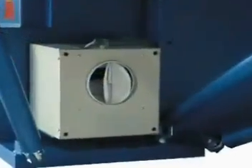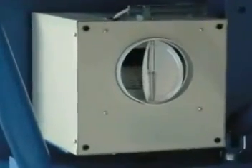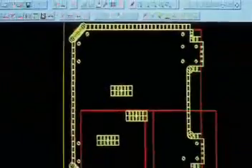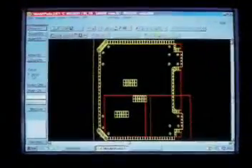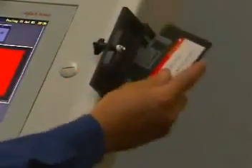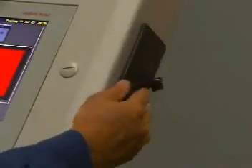The suction system for the scrap avoids scrap being pulled up. A marking tool is available for all series, allowing the marking of sheets with 10 different fonts. The CNC CAD software allows the import and conversion of DXF files into machine language. The files can be transferred to the machine by cable or floppy disk.